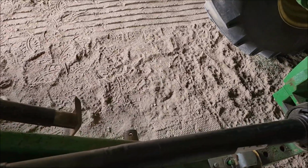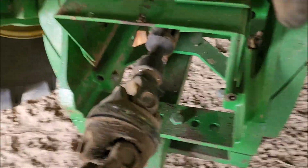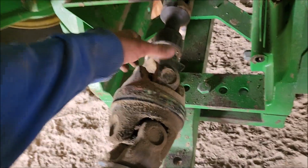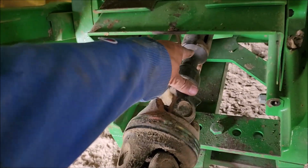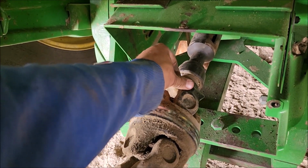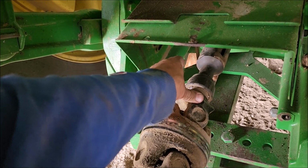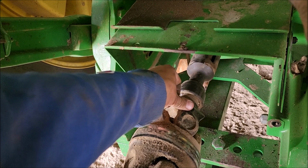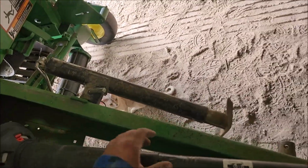Even the shaft. I inquired about just switching the end of this power takeoff, this piece right here, to a large 1000 and getting rid of this adapter. It's $700. Until it becomes a severe issue, I can keep paying the $20 for a dozen or so spare bolts and just change them out every time we run it. I mean, it's not ideal, it's far from perfect.